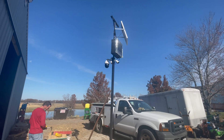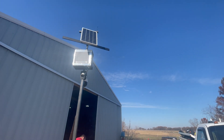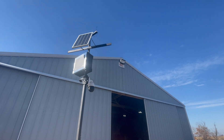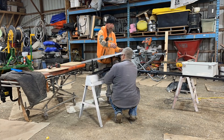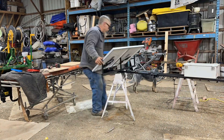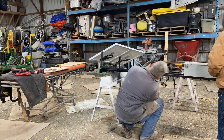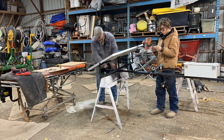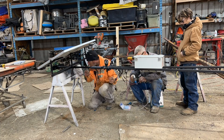You can see our first version. It's a little top-heavy and I'll warn you again later in the video — the wind hits this and it wobbles back and forth, which just sets the motion detectors off on the cameras. We needed to make a way of spinning the solar panels up to 360 degrees so no matter where we set the pod on the farm, we can point them south for maximum solar. The solar panel kits are 100 watt off Amazon. They came with their own charge controller for 12 volts — a nice charge controller with options for programming lower limits.